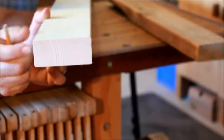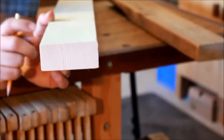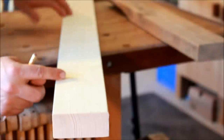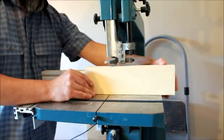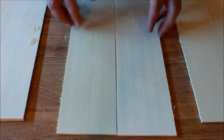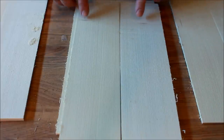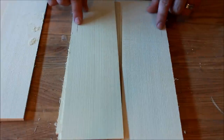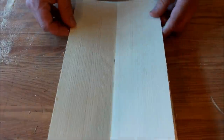First thing I did was to get a piece of 2x4 where I want the grain to be vertical and as close grain as possible. I minimized the amount of knots I had in it. This one has a bit, but I have some big chunks I'll be able to use for the backboard and soundboard. I'm cutting a blank for book matching the soundboard and backboard, choosing the best part of the 2x4. One book match had a little knot in it and another had a little pocket of sap, so I won't be using those.